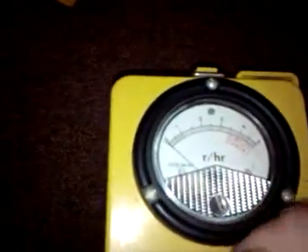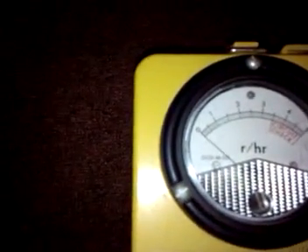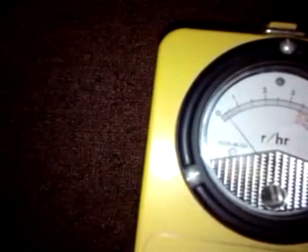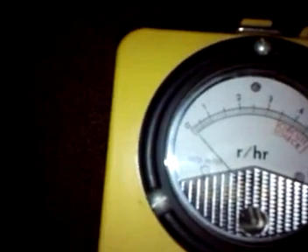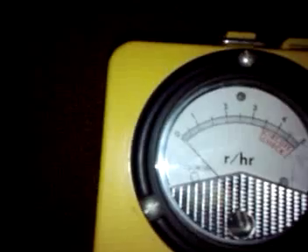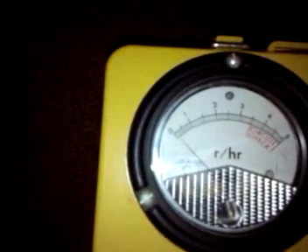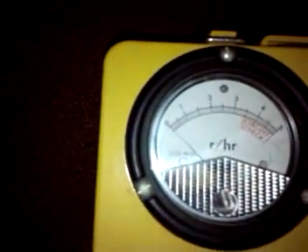Times 1, you see a little peak and it goes back almost to nothing. But times 0.1, which is the most sensitive setting, it should climb back up and drop back down to about 0.3, 0.2. I don't know what this means — I don't know if it's picking up ambient gamma, cosmic radiation, or what. Maybe it's just busted. It kind of wavers and ticks. I have some uranium glass in the house that I've tested it with, and it didn't really set it off — but then again, that's not a gamma emitter, and the instruction manual says this is meant to work in a gamma environment.